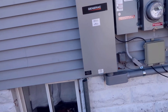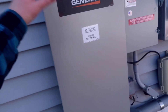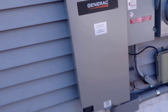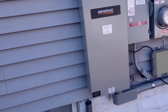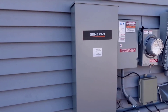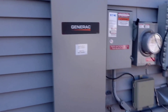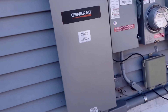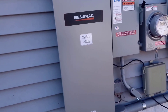I'd suggest putting in an automatic transfer switch along with the generator. That gives you future-proofing capability without having an electrician install a manual transfer switch that you'd later have to upgrade to automatic. The main setup is: have the electrician come in, make sure you have the correct 50-amp cable, and install your manual or automatic transfer switch.